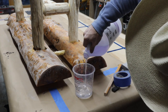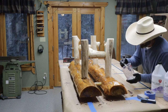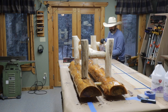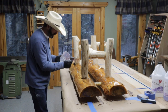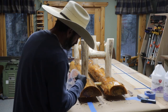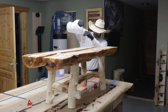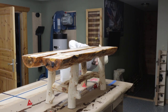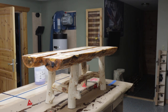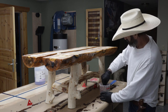The next day I flip it back over and start on the second coat on the bottom. I sand it all, spray it all off, make sure there's no dust, and then proceed to do another coat of epoxy on this side. I had to sand quite a few drips from the top running down to the bottom. Then I mix another batch — this time about 12 ounces. Speaking of mixing, I always put the curing agent in first and then pour the resin into the curing agent. I always mix for three minutes minimum, and I don't usually mix with a drill anymore — I mix by hand.